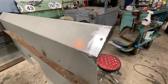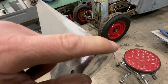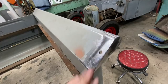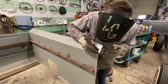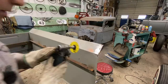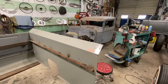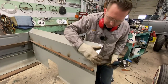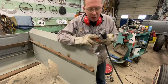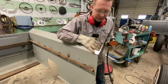We've just finished grinding the first pass, and as you can see we still have a couple little spots that we've got to come back and touch up — but not a huge deal at all. We'll bring the welder back over and burn a little filler rod in there, then hit it again with our second pass. Our second pass cleaned up all the little imperfections, and it's nice and happy now. I've taken the 36-grit off and put some 80-grit on, and we're just going to dress it with 80-grit to get some of the heavy scratches out, then hit this edge with a file and finish it off with a DA.